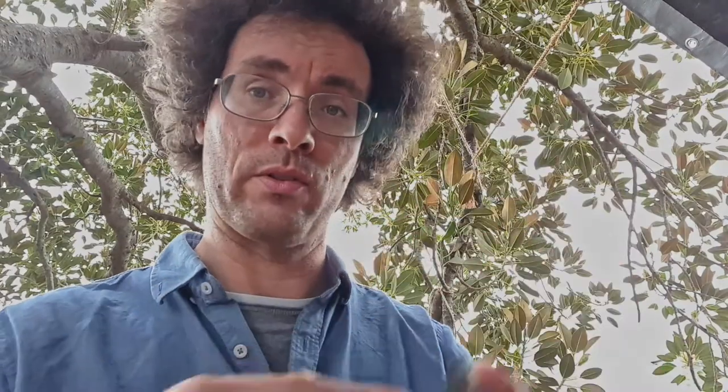As I was flattening this, I was noticing that the back of the knife was only polishing in the center, which showed that there was a camber. Since it seemed pretty even, I didn't think it was a manufacturing defect. So by rocking it backwards and forwards as I was going on the stone, I polished — well, there's good coverage, shall we say. It's not very even, still working on that. But then I realized that there was a back bevel from the manufacturing process, and I was sure enough of myself that that wasn't meant to be there because it wasn't even.